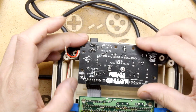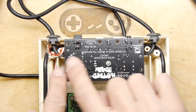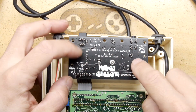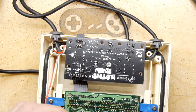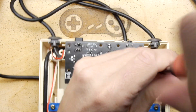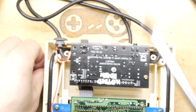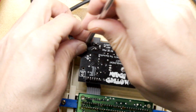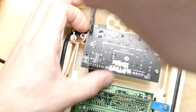Now install the board and screw it in. There are locating pins that make sure it positions absolutely positively. Put the original four screws back and that'll hold everything nicely while we work on the power switch. There are various power switch options on these — I'll show you both when we do the other Famicom flavour. You can either jumper the board or totally relocate the switch. I always go with the jumpering option.